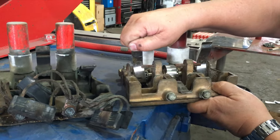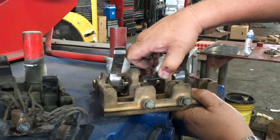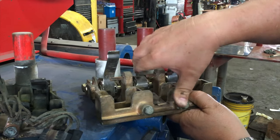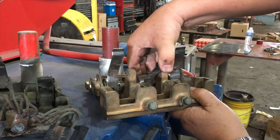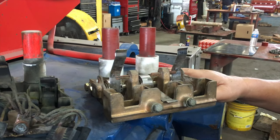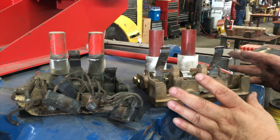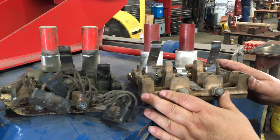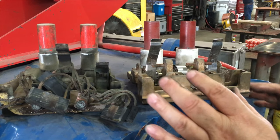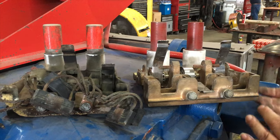These, on the other hand, are constant tension — the brush is always under tension. These holders do not seize or freeze over time. So anytime you have the opportunity of servicing a motor, it would be good to move up to this type of design, especially with motors that don't see as much activity as others.